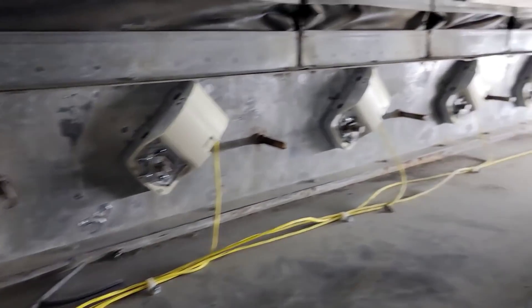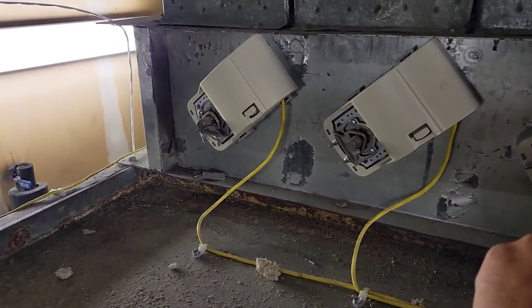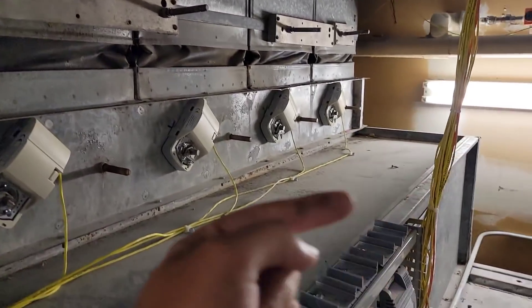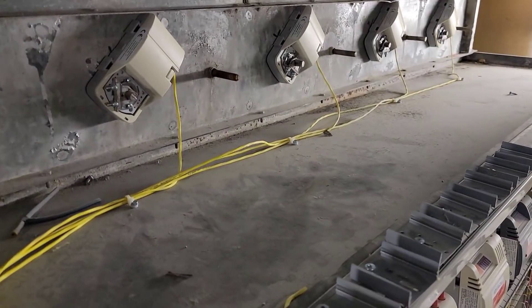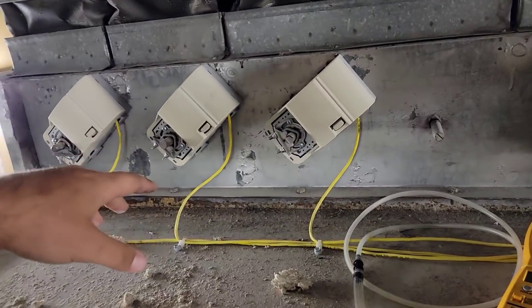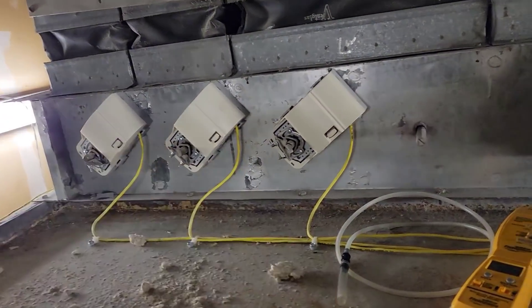All of these are floating point actuators, so they're all in kind of different positions. The wing on this side behind me is the main cold area, and over in this section of the building on the other side is where all the hot zones are. That's part of what we're diving into — just why is that happening.